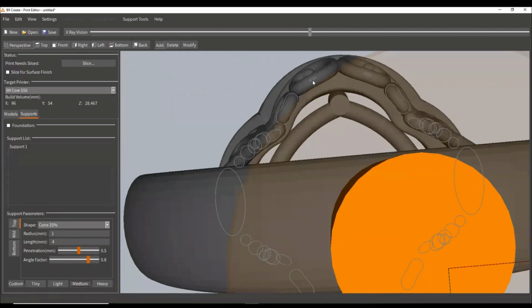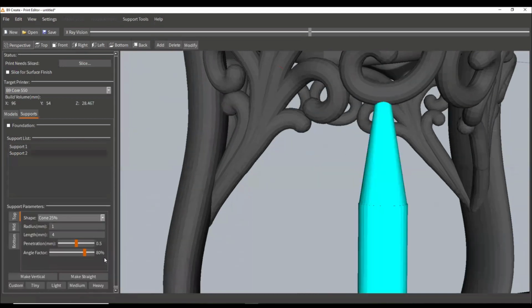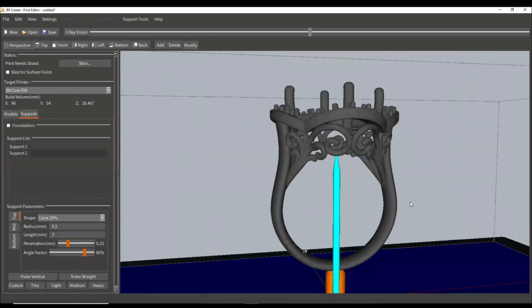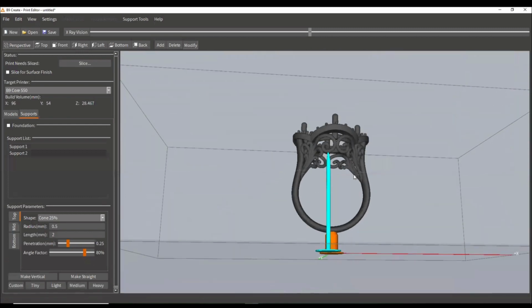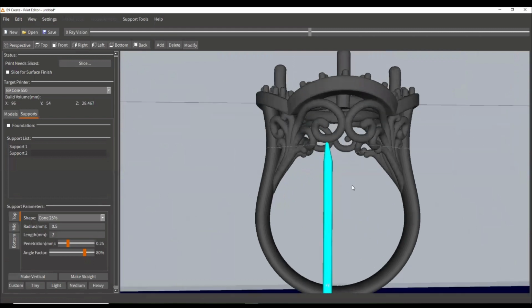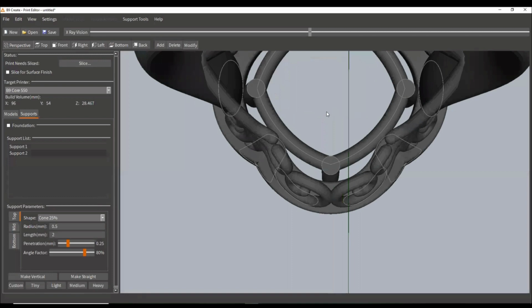All of these small circles here indicate areas that need to be supported. So this particular area, I added a support. I could probably get away with something a little bit smaller, so you can make this light. That'd be about the right size support. So again, what happens when you add a support? Before I added that support, there was no prior layer. This was an overhang, right? The way you can tell is any areas that don't have a prior layer that are parallel to the build table are an overhang. In this particular case, this area is located as an overhang.